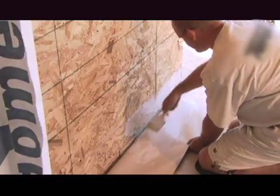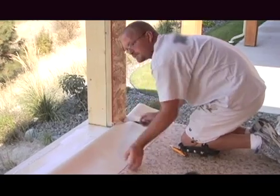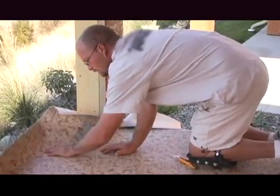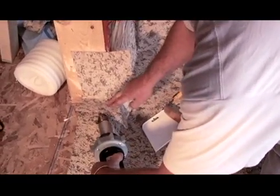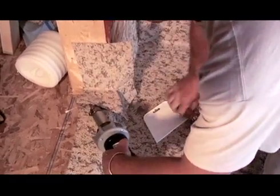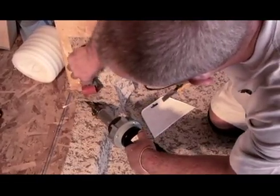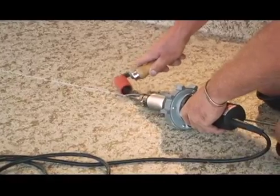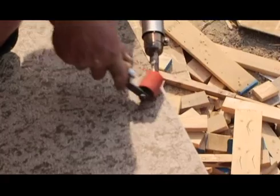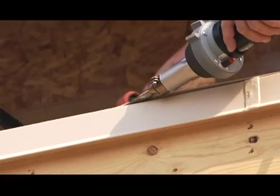All verticals and upstands should also be adhered to the wood sheathing. Membrane flashings are formed and fitted to all door sills, outside corners, and framing intersects. They are glued to the wood structure and finally thermally welded into place using a hot air welder. Overlap membrane seams are also thermally welded together, as are all terminations to PVC-coated metal flashings, creating a totally waterproof installation.